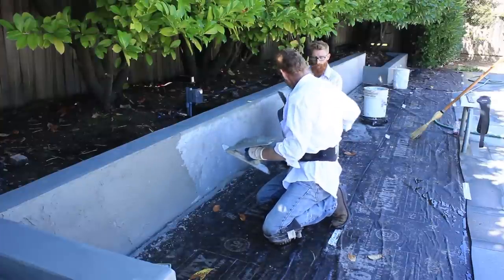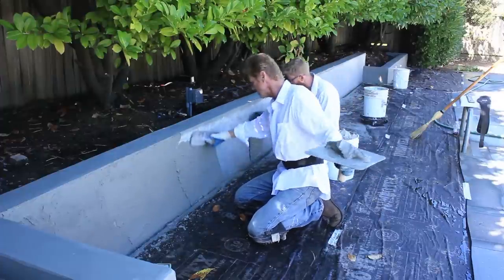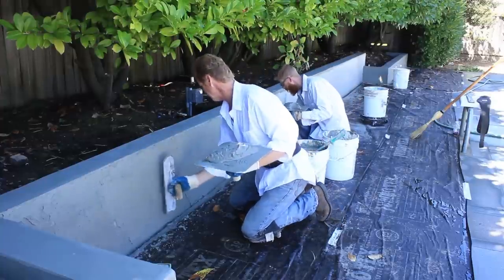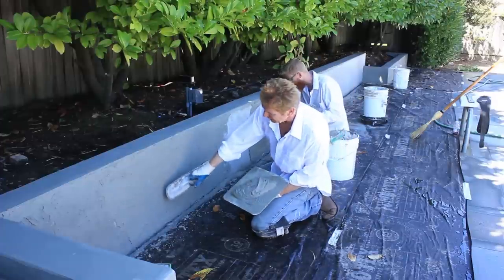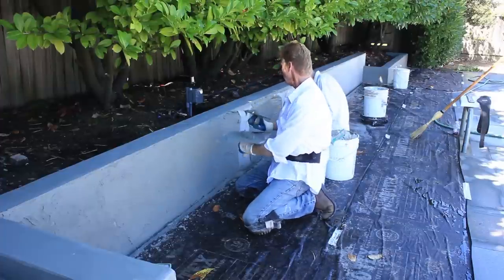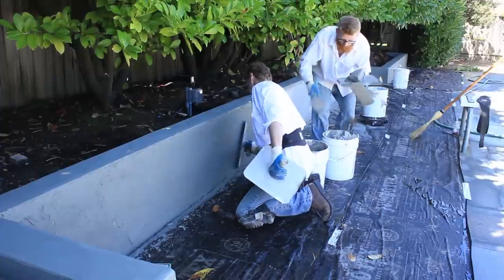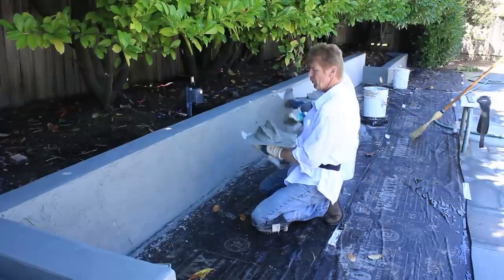Jason is putting on the first coat and so am I. We're trying to find some areas that will show well on camera and we've nearly finished the job. You notice this wall has a lot of big rocks and grains of sand — that's why you put that first coat on for a little coverage. Allow it to set, and then you come back with that second coat. This is kind of like a scratch coat.